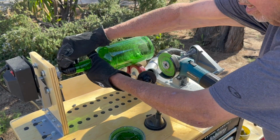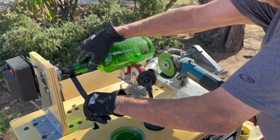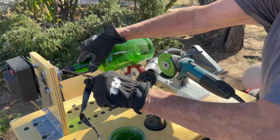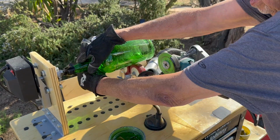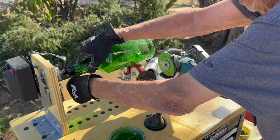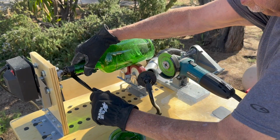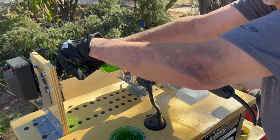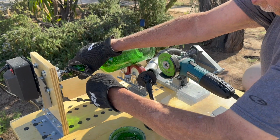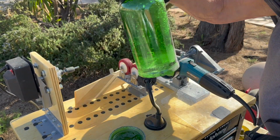Sanding process is really easy. We use aluminum oxide sanding paper. You can get the discs on whatsnewjohnny.com. And a Bauer polisher drives it just at the exact right slow speed so the bottle doesn't get too hot and it doesn't get shocked. I mean, it's a nice, easy process. And I've cut the bottle sanding time down from a few minutes to less than a minute in almost all cases. Heavier bottles take a little bit longer.